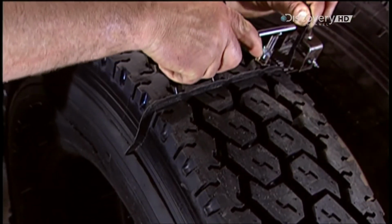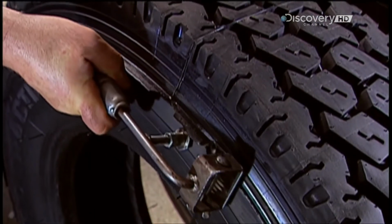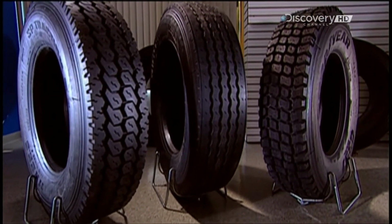After extracting the tyre, workers remove the seams of excess rubber with a special comb. Depending on the size and type, a remold is 30 to 60% cheaper than a new tyre. At considerable cost saving, this remolded tyre is now ready to hit the road.